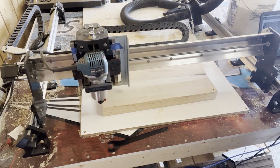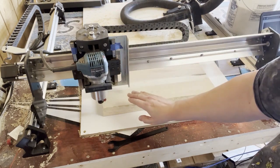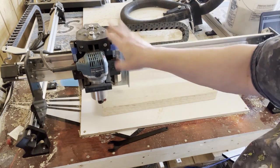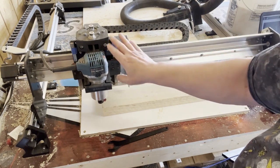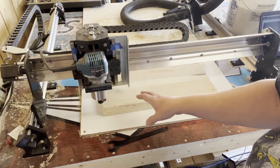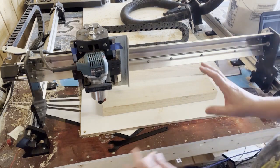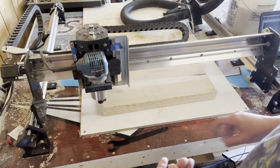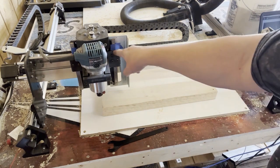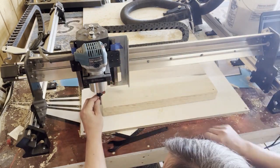It does funny things, this long mill, because you noticed it jogged up before it settled, and it travels beyond its path, and it bumps because we don't have limit switches on this early model of long mill. So you want to keep that in mind. So you could see that it bumped. But it doesn't matter because we're resetting our Y home anyway. I got a little blue painter's tape there so you can tell when it's about to bump into its limits.